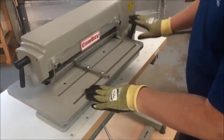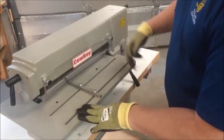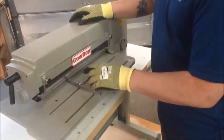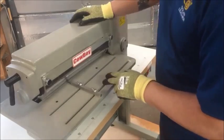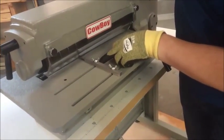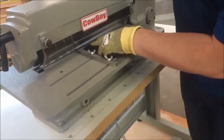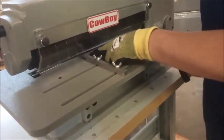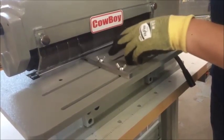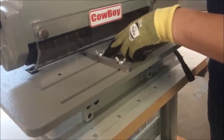Next, we want to drop this platform. This platform allows the blades free and keeps interference from happening, so it makes things easier. Then make sure this guide — if you have one or two of them — is not impinging on any of the blades or keeping them from sliding out. If you need to take them out, just unscrew and remove. If you want to return to the same place, marking with a Sharpie is always a good idea.